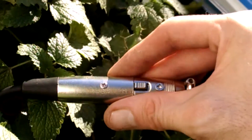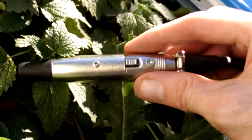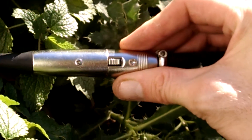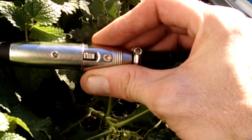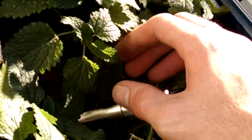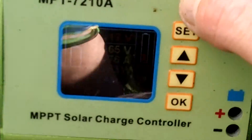So if you're trying to use a standard XLR cable, you might want to check your pin-out on your battery, because I didn't even think about that. I feel kind of dumb now, but it is what it is. Check your pin configuration — I had used diagrams, but they're all set to the standard XLR setting, so I had no idea that it was wrong.